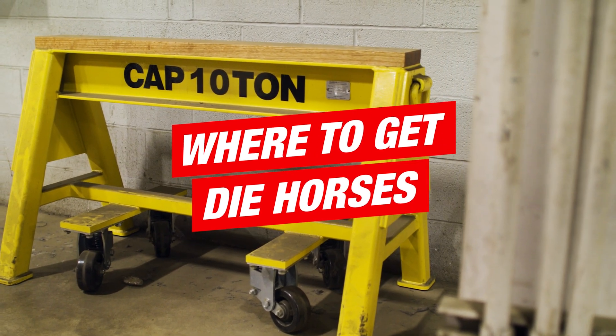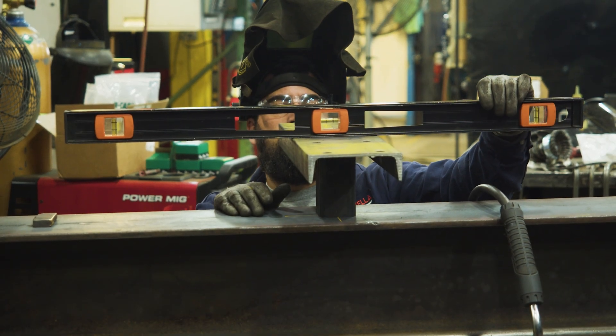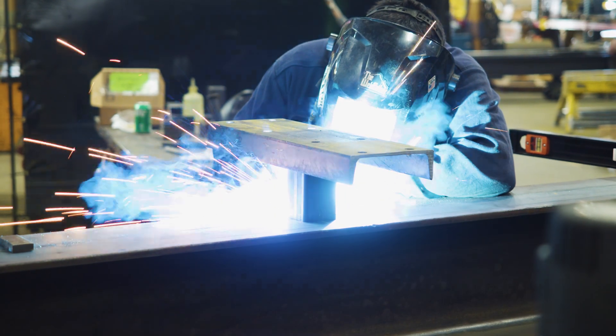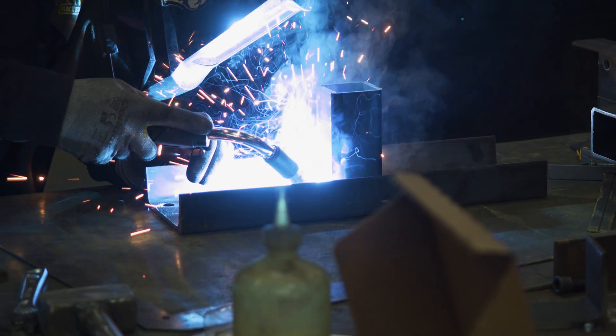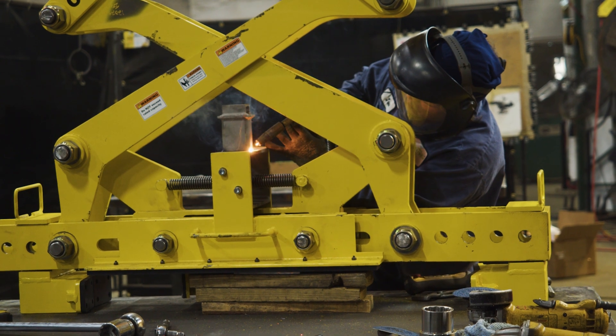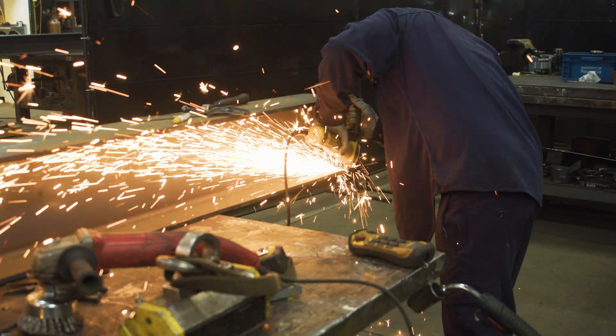There's no requirement that says you have to buy a workhorse from a manufacturer. Workhorses can be manufactured in-house as long as you are meeting and exceeding all ASME criteria, with qualified engineers designing them and certified welders welding them. The welders have to be certified to a specific weld procedure for that particular material, not just a general welding procedure — all per ASME. We have all certified welders on staff qualified to weld all different types of materials, and CWIs who inspect all welding once it's done.